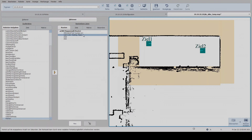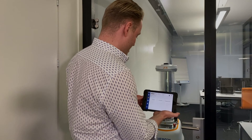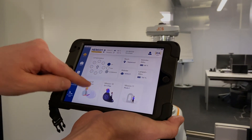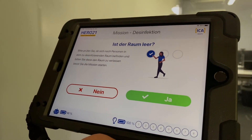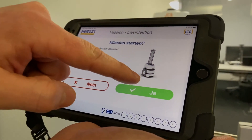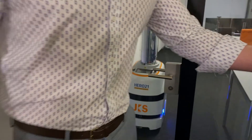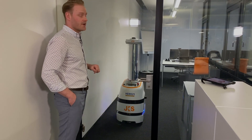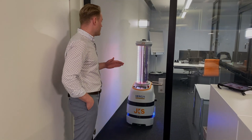Here you can see the sequence: lamps on, then a 120-second waiting phase, then the robot goes to target 2 and then to target 1. Now I'll show you how a real disinfection works. All you need to do is take your iPad, choose the right room, and get an overview of all the programmed missions for that room. I select disinfection. I confirm the room is clear and nobody is inside, then hit the yes button. It asks again to confirm mission start. It takes about 2 minutes for the lamps to start and light up. We have a sonar lidar radar sensor on top — if somebody enters the room, the lamps will shut off automatically.